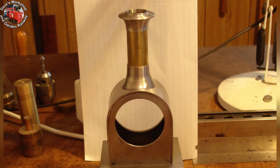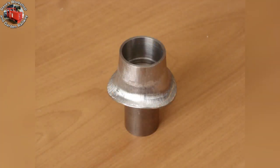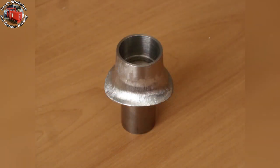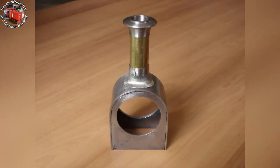The chimney pipe is 7/8 inch OD by 3/4 inch ID brass tube — I had a piece in my metals box just the right length. The tube is turned halfway down on each end to about 0.812 inch diameter. There's a corresponding bore in the chimney cap and base to accept the tube. A longer length in the base is because I want to make the chimney removable — this feature has proved really useful in the quarry hunslet, with changing the blast nozzle and cleaning. I wasn't pleased with the base profile, so I set to it again with the files, and now it's much more like that on the photos of Charles. I finished it with the Dremel. Completed chimney sitting atop the smokebox.